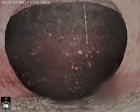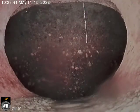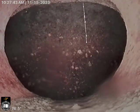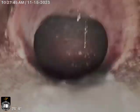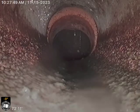I would say more so 70, simply because my footage counter counts from the center of this reel. So subtracting that 5 feet with the distance and the drop — about 70 feet is what we can confirm. This house is 25 feet wide, and you're 5 feet from this side, so there's only 20 feet to the edge of the house. That would make sense why I have roughly 18 feet of cast iron before transitioning to the pipe outside.